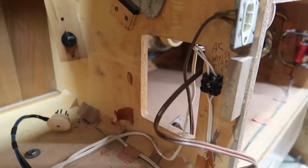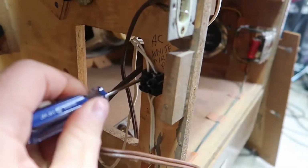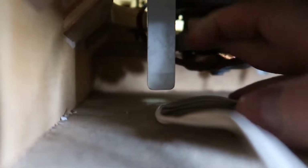Okay, now we want to get the turntable out, so I'm going to take these wires out. This guy's already loose. Now, I battled with this thing for quite a while. There are 3 screws in here that are holding it down. One of them on this side, can't even really see it here, is in the wood. There's a screw, just a nut, way back here that you just can't quite see. Right there. And that one can be released from the turntable by moving it sideways.